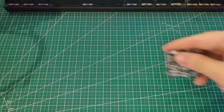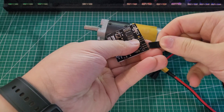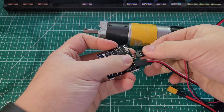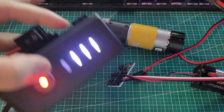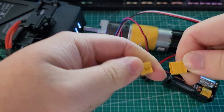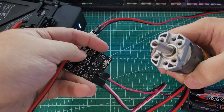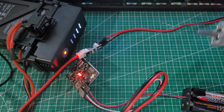But wait — if this board is making the servos move, this can only mean one thing. This little board is just sending a PWM signal to the servos. And with so many components using a PWM signal, you can use this on any of those components, provided they have their power connected. Here, I'm connecting the board to the Rev Spark Mini motor controller, and as you can see, the motor just behaves like a CR servo.